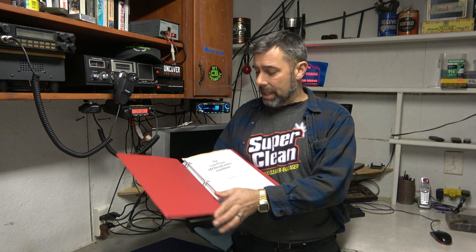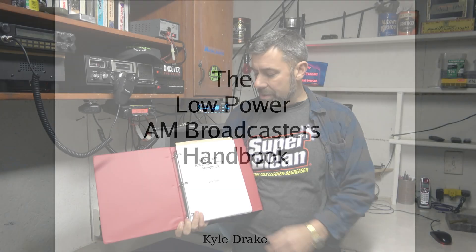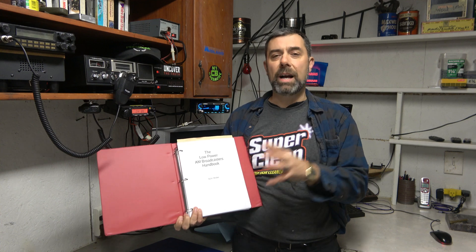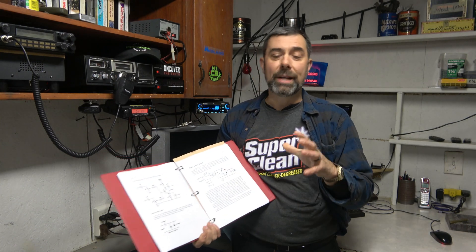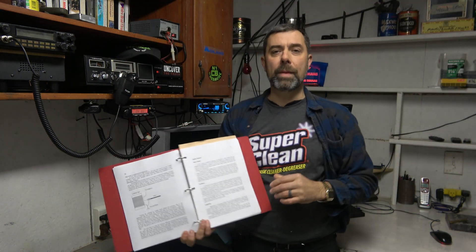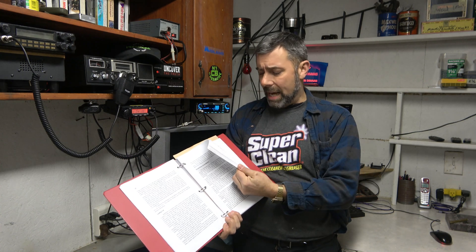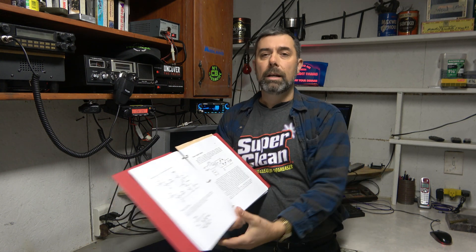I printed these off, but they're going to be in the link. These are two great books you should look into. The first is the Low Power AM Broadcaster's Handbook. This is open source — you can modify it, add notes, do whatever you want. It has tons of info: you could build your own AM or FM transmitter, build power supplies, build SWR meters. It has calculations for making antennas. For AM antennas you're going to need a loading coil, because obviously a quarter wavelength is hundreds and hundreds of feet. This was last officially updated in 2005, but a lot of this stuff is still available. At the back there are links to companies that sell parts. Ramsey, which I think is out of business, might be the only obsolete one on there.